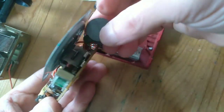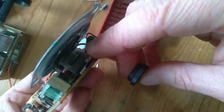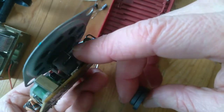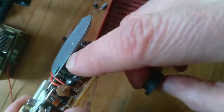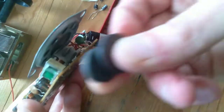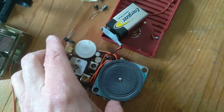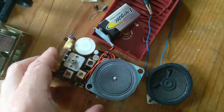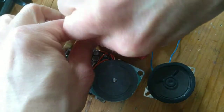So that's a jerry-rig hack of how we can fix, quote-unquote, this reed speaker design that doesn't seem to be vibrating properly with that coil. I think it's because of the defunct magnet in back, because look at how that perked up with a couple of shower curtain magnets. But let's even take this up a notch and put in a proper speaker here without the reed design.